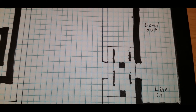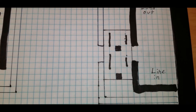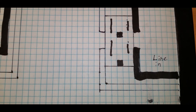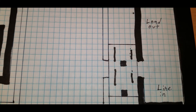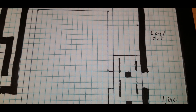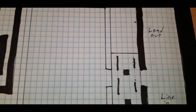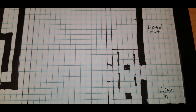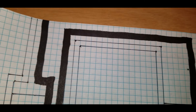Here's the change I made for the overhead lighting. I installed it by hooking up the line in — the hot wire — to the hot side, and the neutral to the neutral side. Then the line that went to the switch: I hooked up the black wire to the hot side. You can also tell by the screws — brass color for the hot side and silver or chrome for the neutral side. That wire feeds in and back out from the receptacle and continues over to the switch.